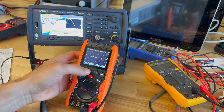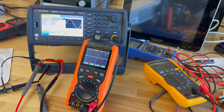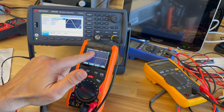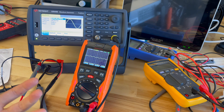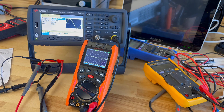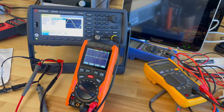I can try to zoom in a bit by making the voltage division smaller — but I can't actually go any smaller. So you can already start to see one of the limitations of this meter: the smallest voltage division I can do is 500 millivolts, which is a pretty large signal. If you're going to use this for voltages above one volt, this will do great. But if you're looking at really small signals in the millivolt range, this may not be the best meter for your application. And that's okay — at this price point, you're going to have some limitations.